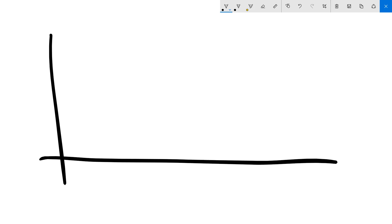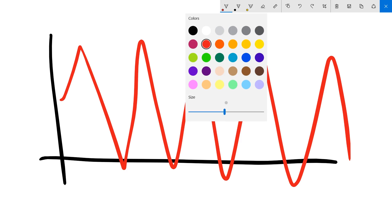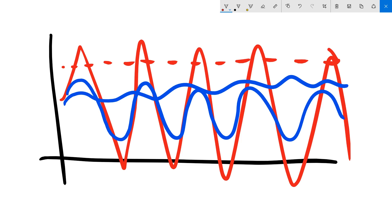That's why a capacitor acts as a low-pass filter. Going back to that screen where we had the voltage looking like this — with all those noise spikes — what the capacitor is going to do is round off those edges. That's what a low-pass filter does, making it look something like that. And eventually, as you filter more and more, you'll end up with just a flat line — very, very filtered, maybe excessively filtered depending on your application. The point is the capacitor is not doing what the TVS diode did, where it just chopped off the top. The capacitor is rounding off the whole thing.